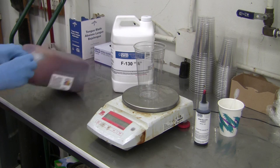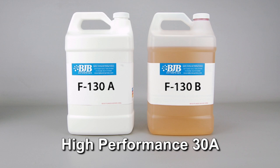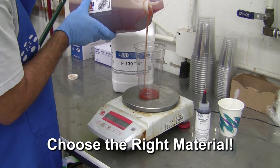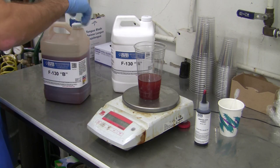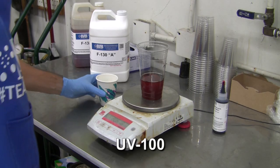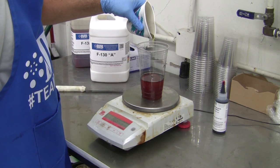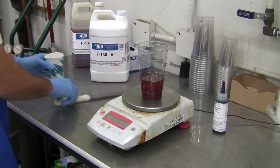We need our gasket to be fairly soft and flexible to replicate the original piece. We choose our F-130 High Performance 30 Shore system. This castable urethane exhibits good tear strength and heat resistance. Be careful to choose the right resin system for the job, or you might find lower grade systems will deteriorate quickly in a harsh environment. We add BJB's black pigment to the B-side to match the original color, and we're also adding BJB's UV100 additive to help protect the rubber from occasional UV exposure. Soft rubbers are more prone to UV degradation, so adding a black pigment plus the UV additive will help.